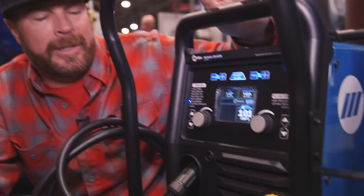Another thing I really like about this welder is that there's not a lot of setup time. If you are a guy that's going to be MIG welding and TIG welding at the same time, the same day, you leave everything plugged in. Both bottles can be present here and connected to the machine, so you've got your Argon and your Argon CO2 mix at the ready all the time.